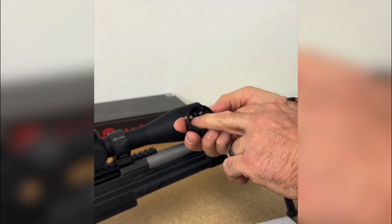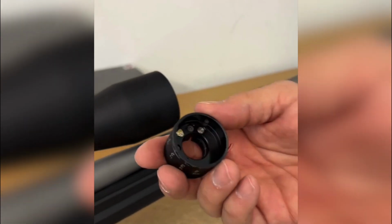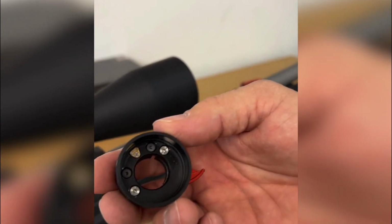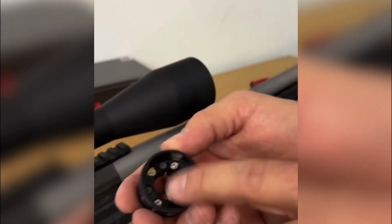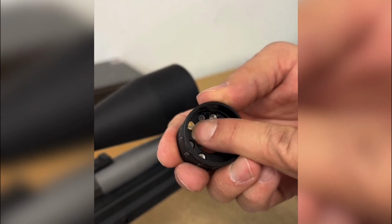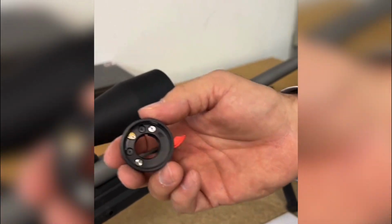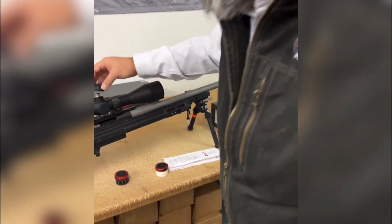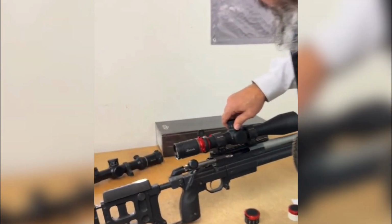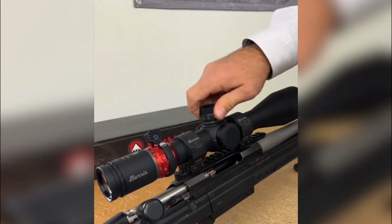Another additional feature on here is something we got back on our XTR III and our XTR II: some people like the zero stop right on zero, and other people would like to have a few clicks past. So this little brass piece on here, you turn this one off, it's got a zero on it. Right now it's saying that the zero stop is on zero. If you take this off and turn it upside down, you can get 4/10 past. So putting this thing back together, once you've zeroed the knob, you put the knob down, just push it down to zero, turn it to zero, close the cam bar, and now it's on.